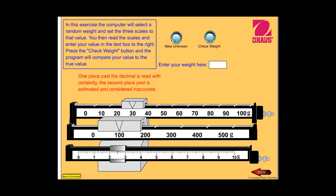First, notice that there are three beams in the triple beam balance. This one you count with ones — the ones place: one, two, three, four, five. The second beam is the hundreds place; you count by hundreds: zero, one hundred, two hundred, three hundred. And the third beam you count by tens: ten, twenty, thirty, forty.